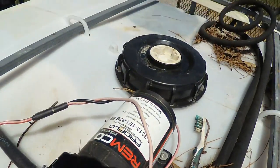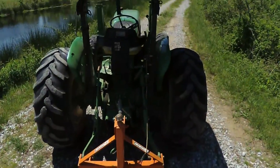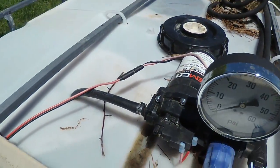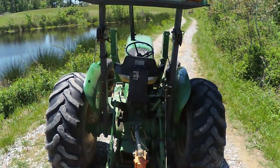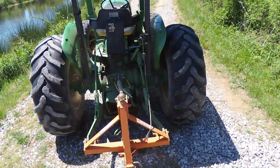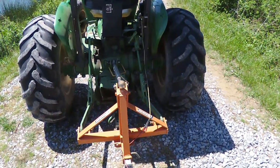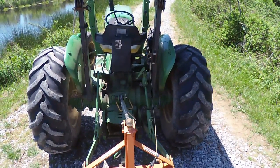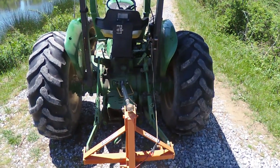As far as turning it on and off goes, I've actually got two wires together so that it would reach all the way up there. These are your standard switches that you would buy in the sprayer section at Rural King or Tractor Supply, and they're just running up to the battery on the tractor. I've also used a pickup truck and a Suzuki Samurai with this sprayer in the past, and that length of wire worked perfectly to reach up to the cab of the truck or the Samurai and be able to switch it on and off up there.